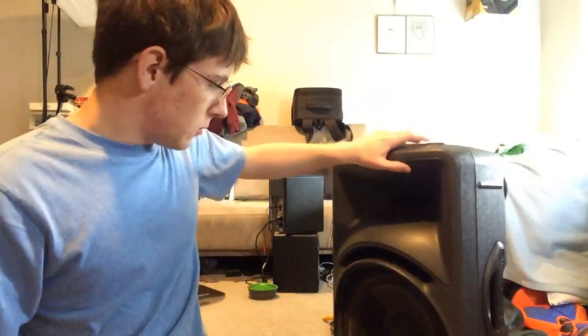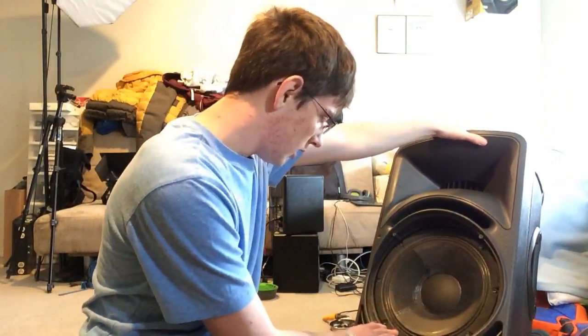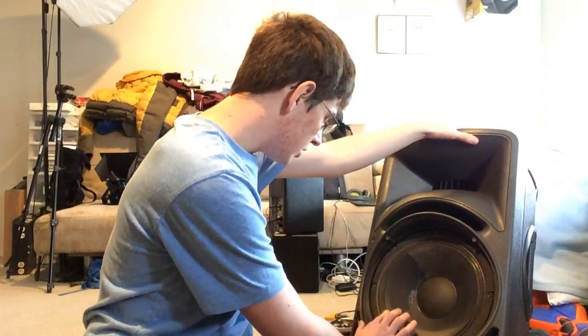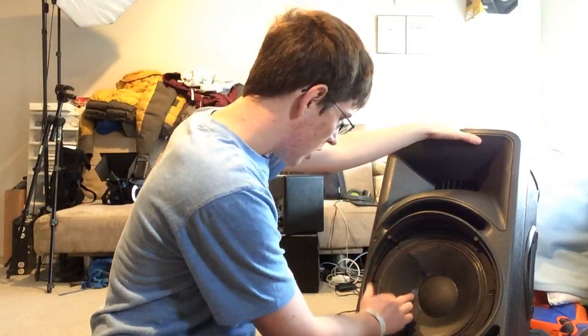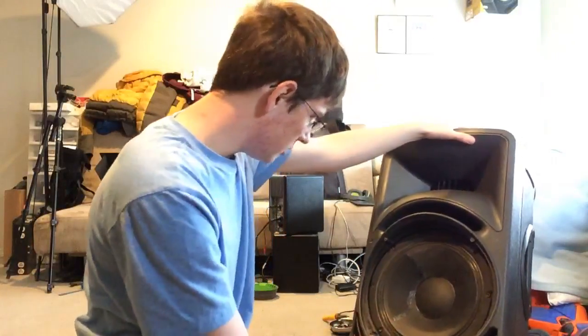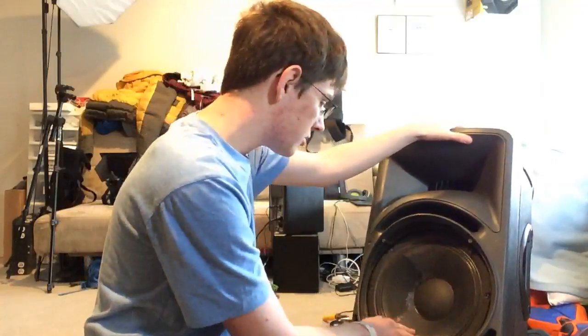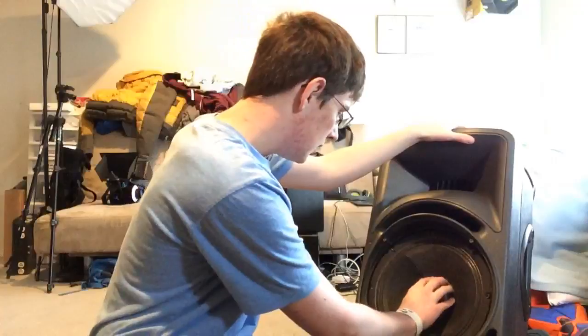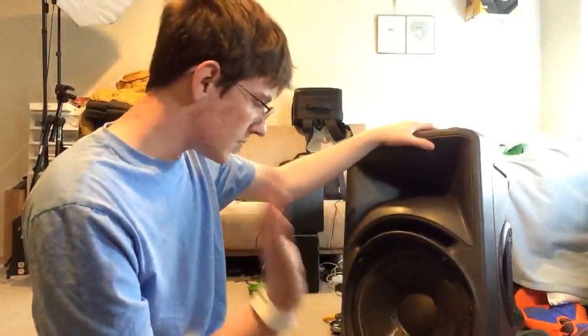This one's going to be a little bit more difficult to judge because there's a little bit of a woofer repair job — this is the original woofer, we didn't want to get rid of it. We used contact tape or permanent hold tape for the surround, and around the edges I did a tiny bit of hot glue just to make sure it's air sealed. I did not hot glue it at the top because you do not want to mess with the suspension. As you can see, it's perfect again.